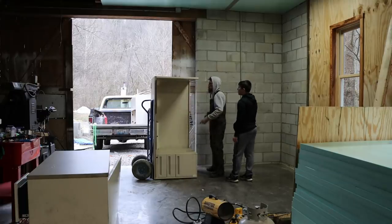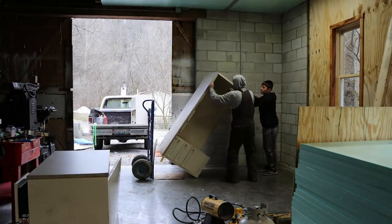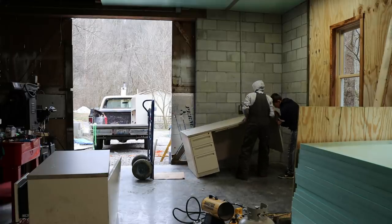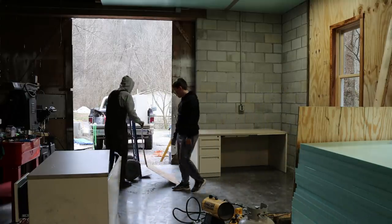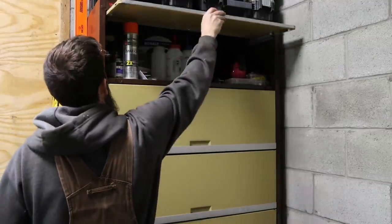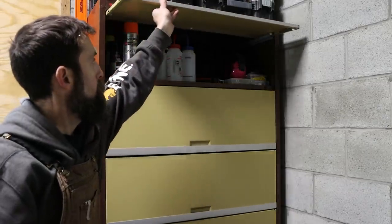So this week is pretty much a continuation of last week's video. We're moving forward, putting up the ceiling in the shop, trying to get a few things organized around here. We're using the 4x8 sheets of 2-inch thick polystyrene foam for our ceiling, held up with wood strips. But there's a lot of work other than just installing this ceiling that has to happen before it goes up. So this week, quick one, onward with the ceiling installation.